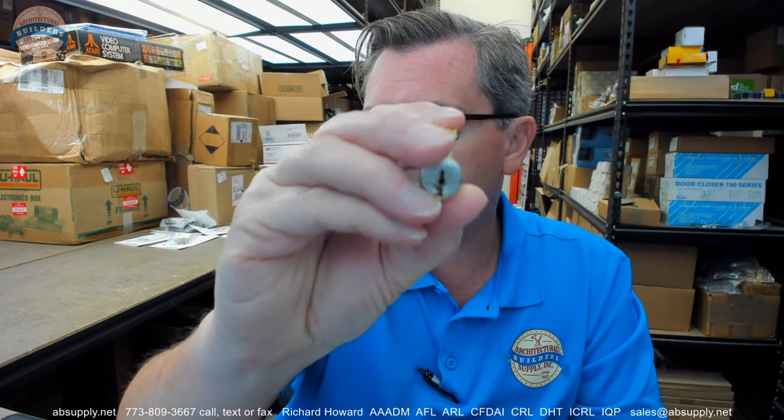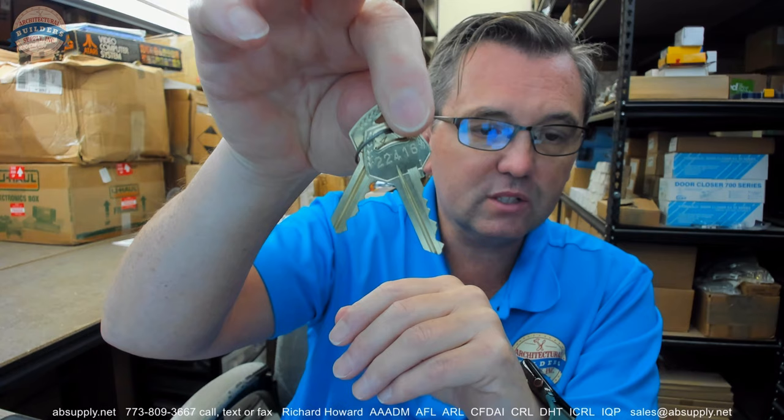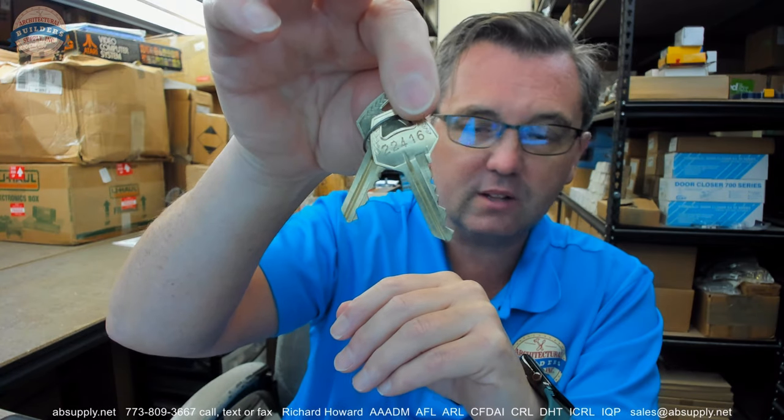So the 15795 means Sargent or Wiser. That means that it is a cylinder that is drilled for six chambers but it is pinned five — that is the last five in the part number. However, this key has five cuts on it. It has five direct digits, or a direct code, indicating what the cuts are.